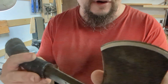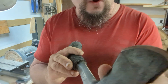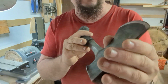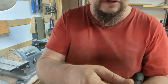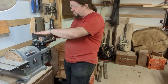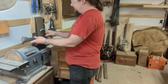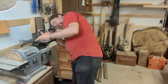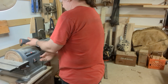Now you can see there's a stripe that's untouched right near the edge, which means my angle wasn't exactly where it should be — or another generous interpretation would be that I've left a micro bevel for me to sharpen. I think that is actually the interpretation I'm going to go with, since the edge is quite sharp. I will do the same thing to the other side. This is why I've abbreviated this platform here — I've left space for an axe handle to travel under it. Now I'll gauge the angle the same way, and I think this will similarly give me a little micro bevel left.